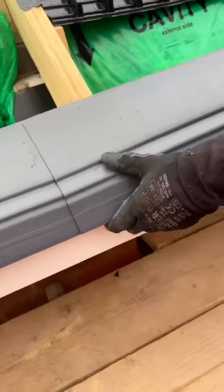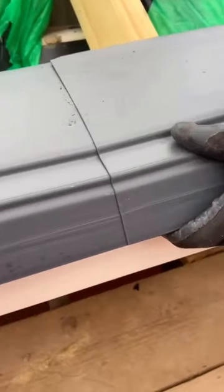When fitting, we put these on the second line with a two inch gap from the fascia, allowing it to run into the gutter. We make sure there is a four to six inch gap overlay so it sits more securely and prevents things from getting underneath.